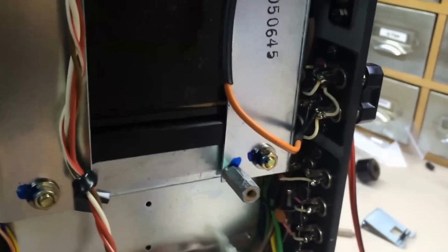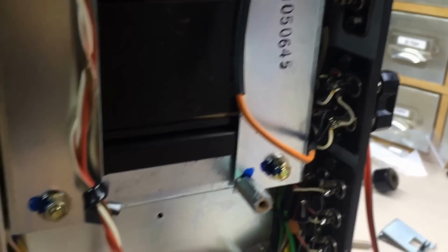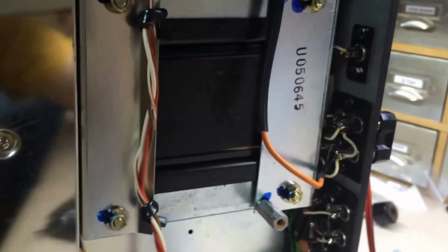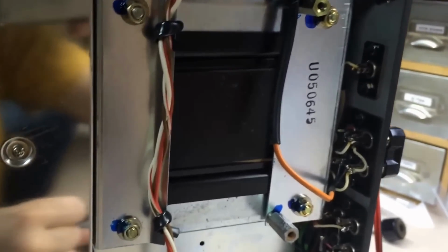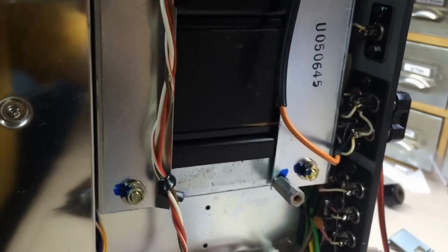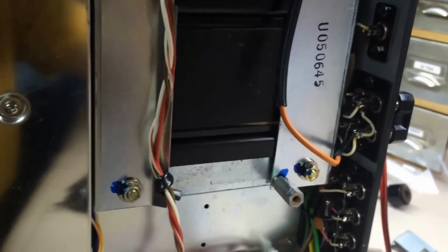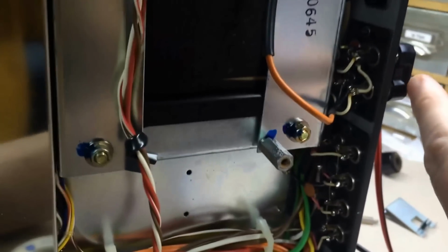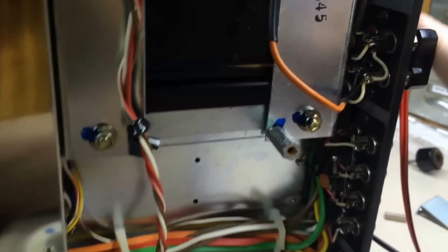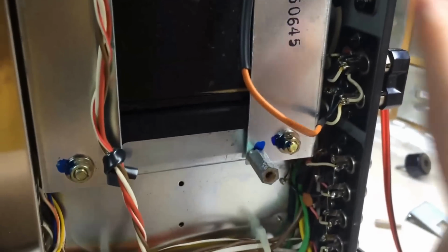Let's say you had some type of great big amplifier, a Krell or something really big with a lot of power. You could use the preamp, the phono stage, the AM/FM of this to feed another great big amp. Or you could do the opposite: come from another preamp and feed into the pre-in here and just use the output sections of this to power your speakers. So when you remove these jumpers, you don't get any sound from the front to the back.